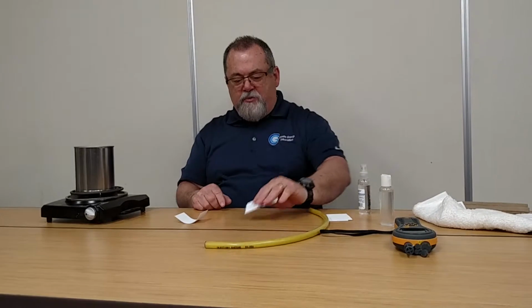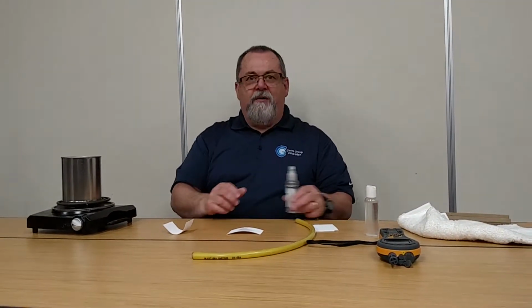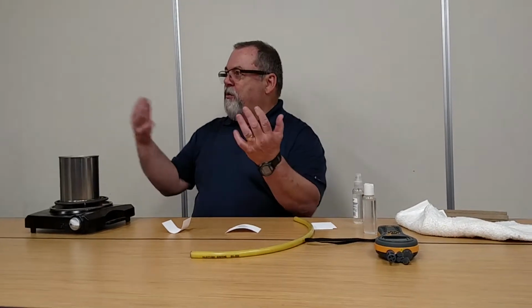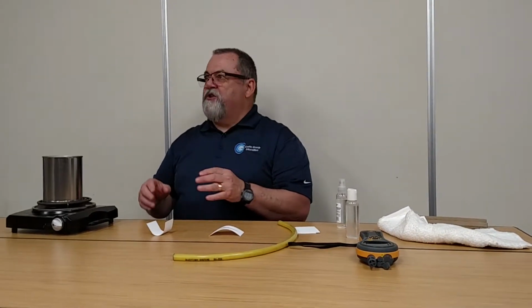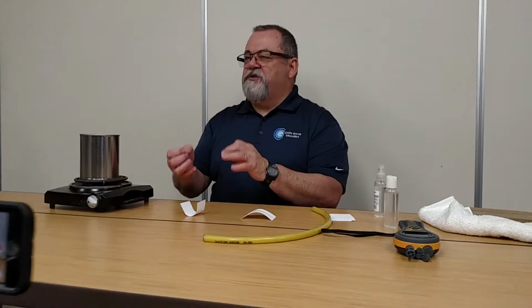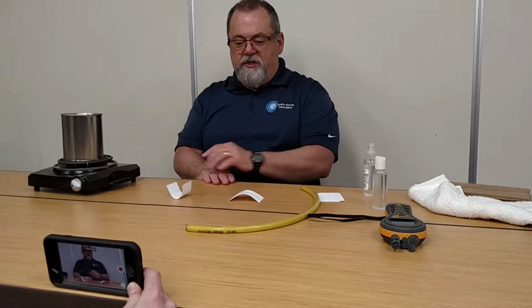Now watch what happens when the top is wetter than the bottom. You always get crowning. So let's say we're all on a water job. Now I'm going to test you guys, so you'll be on videotape. Good luck. We're on a job, and you take psychrometric readings outdoors and indoors. The grains outside are a lot lower than indoors, and it's a nice warm day. What kind of drying system can you be using right now? Okay. Listen to these people. Excellent. Now when you walked into this room, it was a cupped floor. You walked into this one, it was crowned.